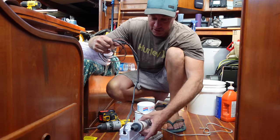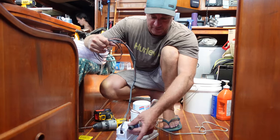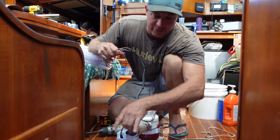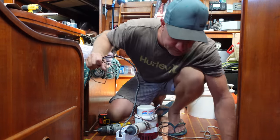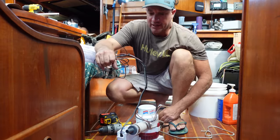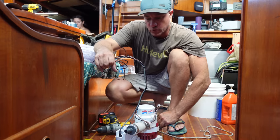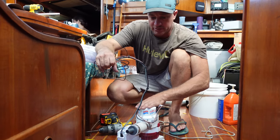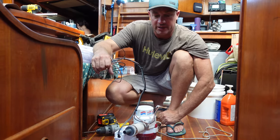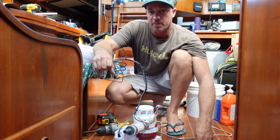So it sort of defeats the purpose a bit of having such a big pump dropping down in size. But that being said, there are another two bilges set really high, which are a Rule 8000, so it's two big ones joined together. So if we were holed, the next lot of bilges would take the water. They're not wired up yet, but this will do for now, and then when we get back I'll finish wiring up the two big bilges. So there should be three bilges down in our main bilge. Should do the job.